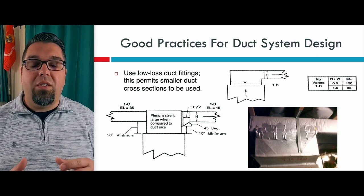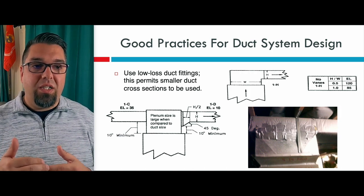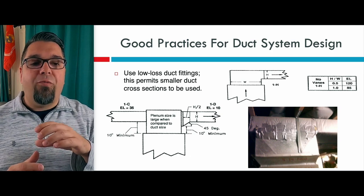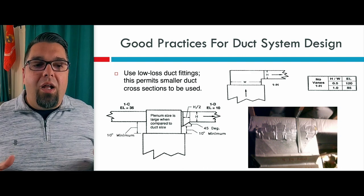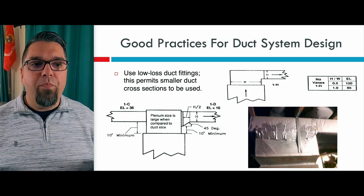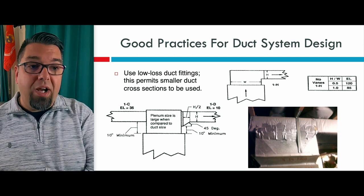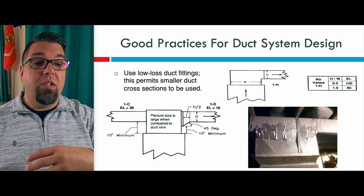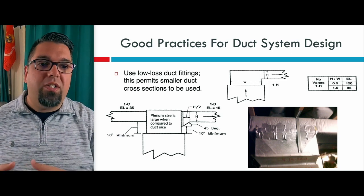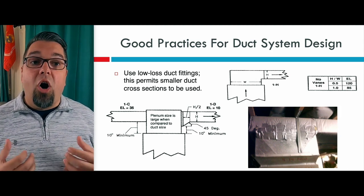A great example of a bad fitting on the bottom right would be that bullhead T. Because the height of the duct is about half the width in this example, without turning vanes in there — which most people don't do — this is usually done where people rough in the trunks and branches during new construction, then come back and put the furnace and A-coil right underneath that trunk, stabbing into the bottom of it. This is a bullhead T, and when you do this, it's a 120-foot fitting, or a 0.12 pressure loss — a huge pressure loss and why you can't get air down to the end of the duct system. Most people will start turning the air speed up, and then you have to add refrigerant. It's a vicious cycle when it comes to air conditioning performance, and the removal of humidity isn't very good. All because of one bad fitting.